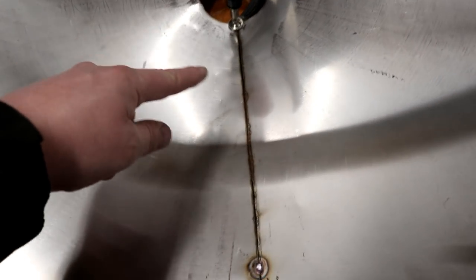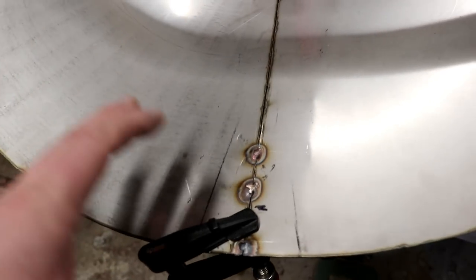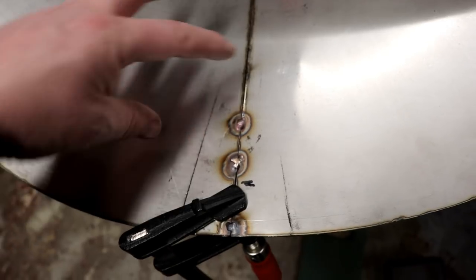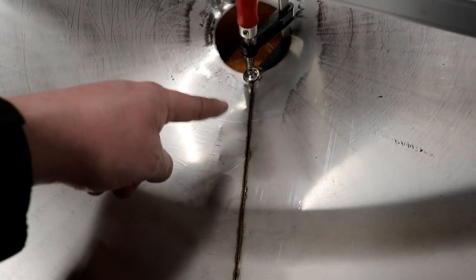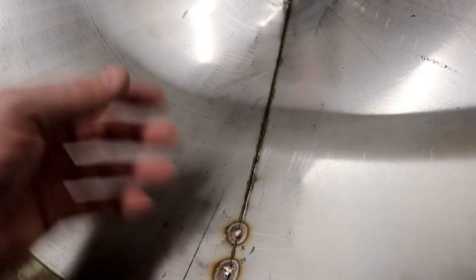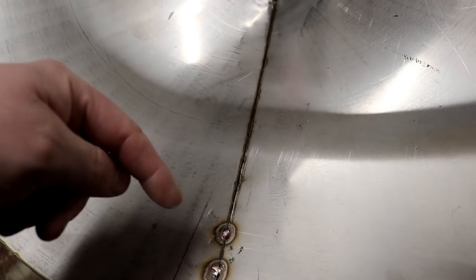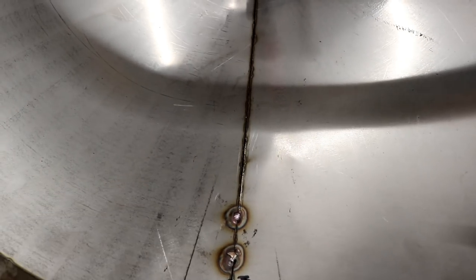The fit is pretty good but it's difficult to wrestle them around - the gap is wider at the top than at the bottom. So I'm using the weld to pull it in: when I put a tack there and it cools, it contracts and pulls the metal in. As I work my way up it's like zipping up a boot lace, and when the top closes I'll switch and put one at the top so it doesn't over-pinch, then one in the middle, and so on until we've got tacks every inch. When I come to weld the seams I'll put the backing bar on and back purge to get a nice hygienic weld. I've been dipping the rod as well - getting the hang of that, it's tricky.